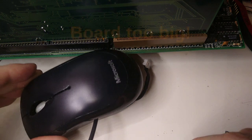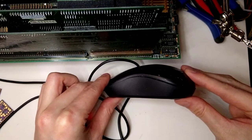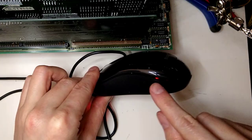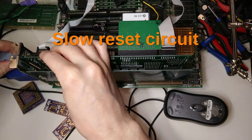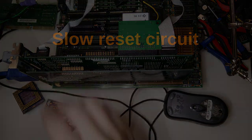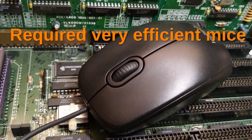The main problem was that the board was too big, with bulky through-hole components, and it wouldn't fit nicely in a Microsoft Basic Optical Mouse version 2. A second problem was that if you unplugged the mouse you had to wait for more than a minute until you could plug it in again. And finally, other modern mice that consumed a bit more than that Microsoft mouse wouldn't work.